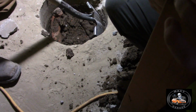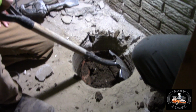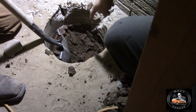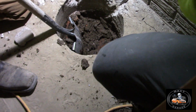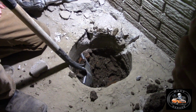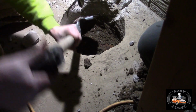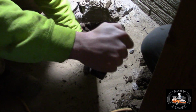Hearing. Yeah. Do you think it's connected to that? I'm hoping not, because if it is, I can't hook your sump pump there. It could just have been backed up the whole time. It very well could be. I'm thinking that's the sewer. You may have to move that and then fill that in. That can't be the sewer if it's got a drain in it. That can't be exposed like that if it's the sewer line. Where's the other standpipe at? That's it. Well, that's the clean out. There's no other standpipe. Actually, all that might be why it was backing up, because that was filled up with dirt. Because when it rained, I heard water running. Yeah. Could be.